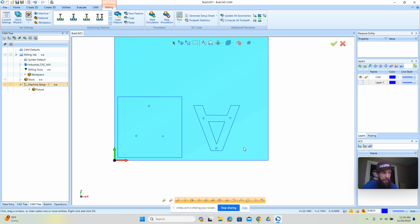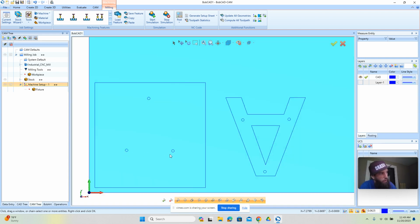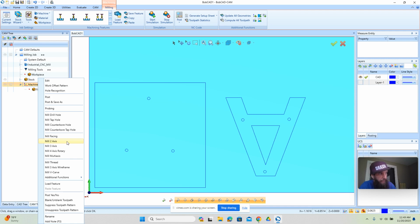So we have 250 holes, so we're going to profile everything. We're going to use one operation and do everything one way, and we need to make sure our tool is small enough to fit where it needs to go. Okay, so if we're in a 250 hole here, our tool would either need to be 250 and just go down into that hole, or we would need it to be a smaller diameter than that in order to profile around it to offset.